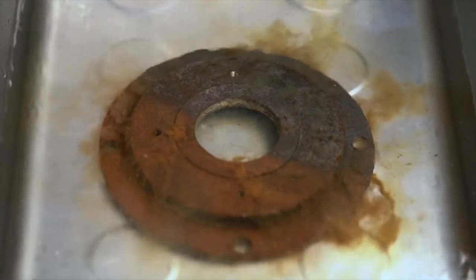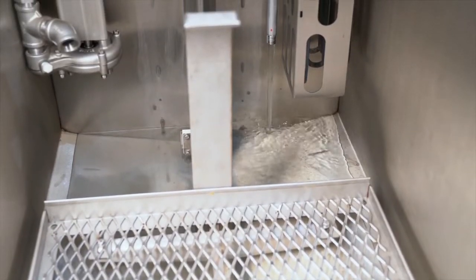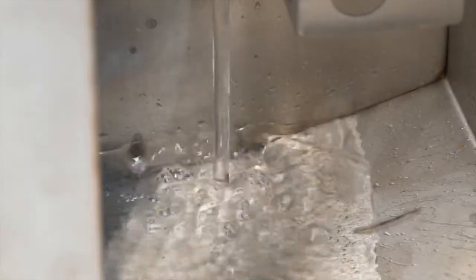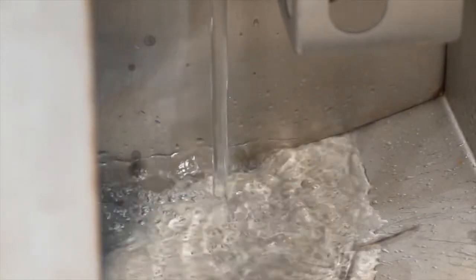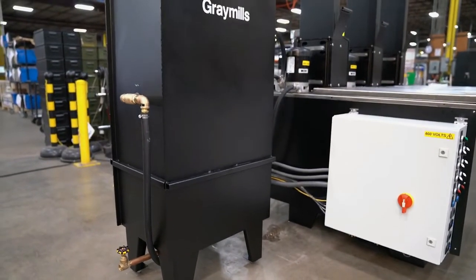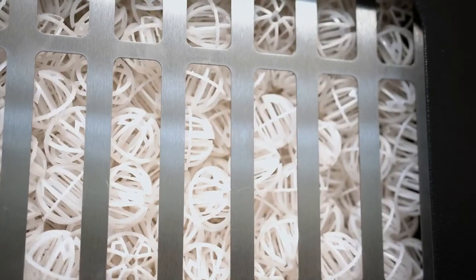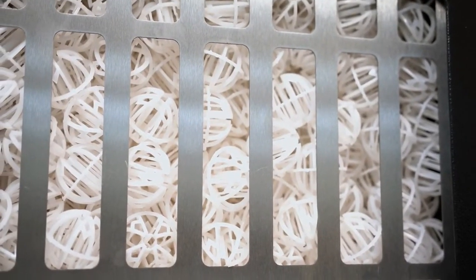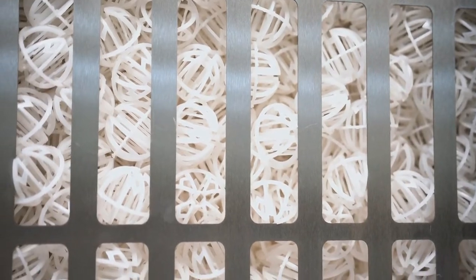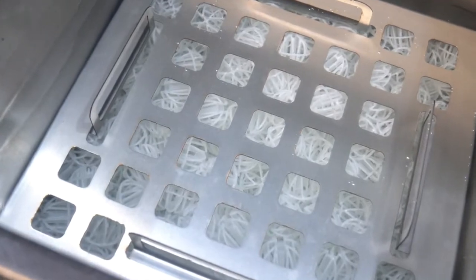The action scrubs hard to remove contaminants. The cascade water option reduces waste stream by 50%, extends the life of the cleaning solution, and automates the task of filling the tanks. The Gray Mills OSEP is an oil coalescer and works by pumping the solution over polypropylene spheres, which retain the oil and return the detergent solution back to the parts cleaner. This can result in cleaner parts, extended cleaning fluid life, reduced waste, and increased production time.